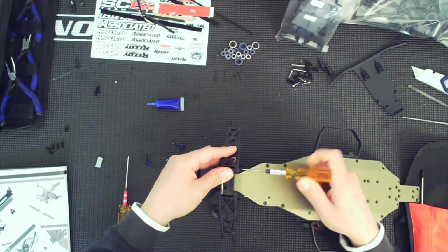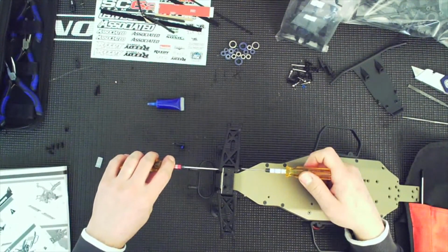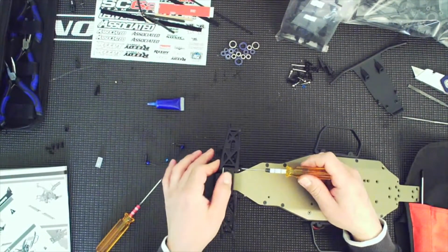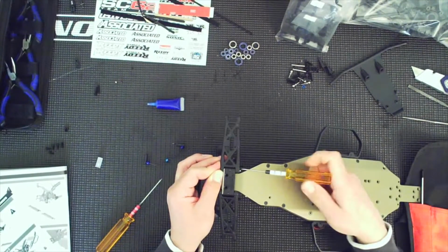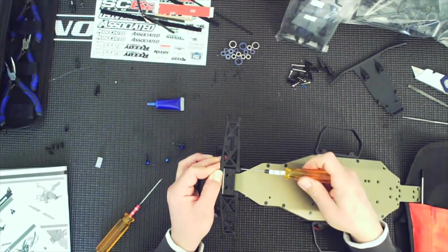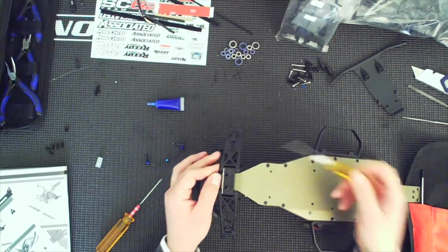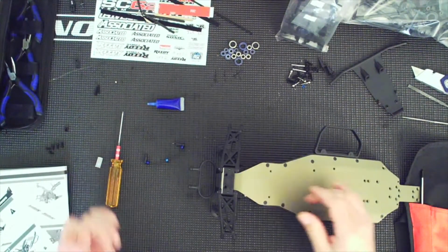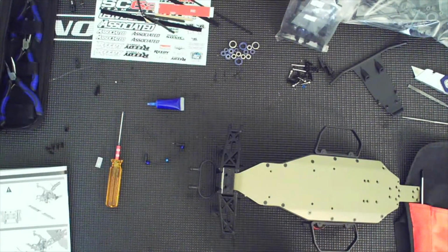Here goes the other one. So here I will exaggerate this. I'm going to push this hinge pin further out. There, so you can see how it's out. So as soon as you start driving this in, it'll just move the hinge pin forward. So that's the purpose of these screws. Do not lose these screws. That's it. Also, make sure they're snug. Do not over tighten those. You do not want those stripping. But that is it. That's how the arms will be fitting.